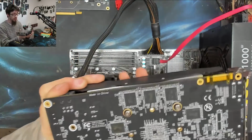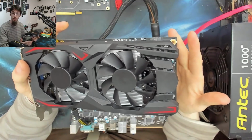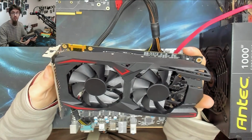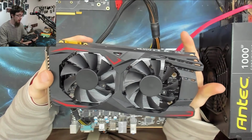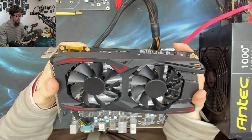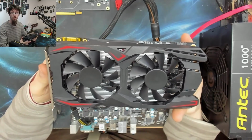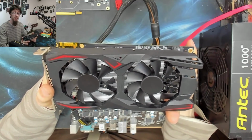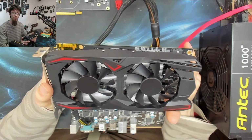But there is. As I say, Linus Tech Tips did a video about these where, when you look on eBay, you can find these allegedly 1060s for really cheap, like between 40 and 80 pounds, just suspiciously cheap. And everyone's just like, is it real? Linus Tech Tips bought one of these, did a test, and discovered that it was genuinely a 1060 5GB version made for the Asian domestic market. It was specifically aimed toward cyber cafes in the Asian market where they wanted really cheap gaming graphics cards, and it was genuinely a real thing.